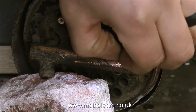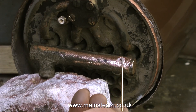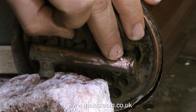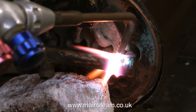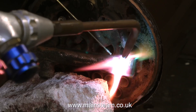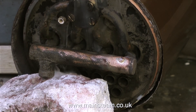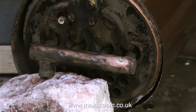What we're going to do is plug this hole using a one-eighth of an inch diameter rivet that I've just tapped into the hole. This is John's hand — which is a lot cleaner than mine for some reason — and he's applying the silver solder flux to the part going into the hole, the one-eighth rivet. Just to be sure there's enough flux, he's applying a little bit more. Now he's going to use an oxyacetylene torch. This torch is more than capable of cutting through steel by melting it, so he's been very careful and hasn't got it turned at full blast. The oxyacetylene system allows you to apply an incredibly high amount of heat to a very small part of the boiler, and in no time at all the silver solder melts and flashes round the joint. And the only bit that really got hot was the combining tube on the superheater.